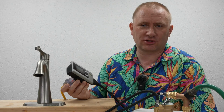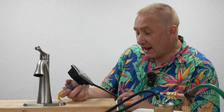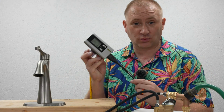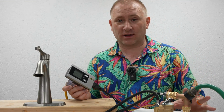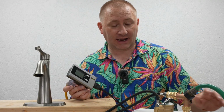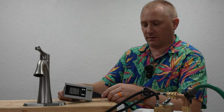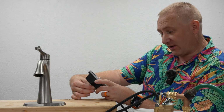Now this guy tells you basically how many amps you're drawing, but also the cost per month. That cost per month is based on the amount of amps you're drawing at that second, or at least over the time. So right now, because we're drawing 12.4 amps, if this was to run constantly all month long at its high setting, and I'm going to set it to its max setting quick just to make sure, 12.5 amps is what it's running.